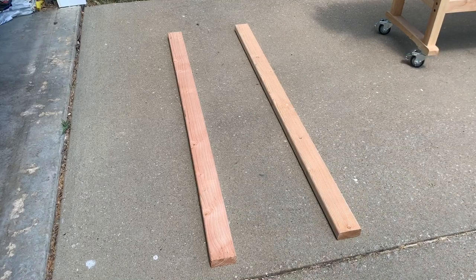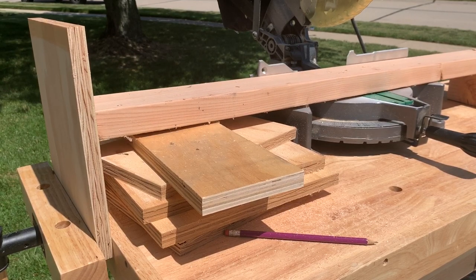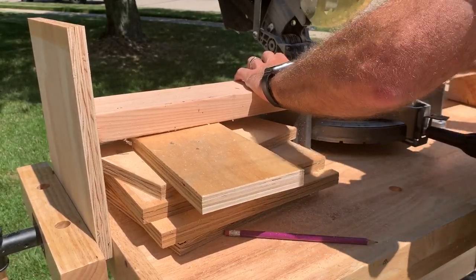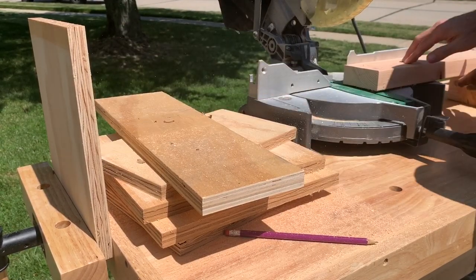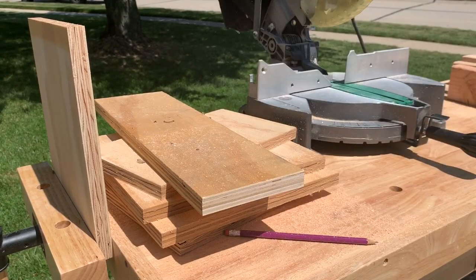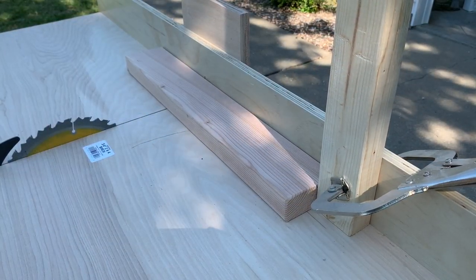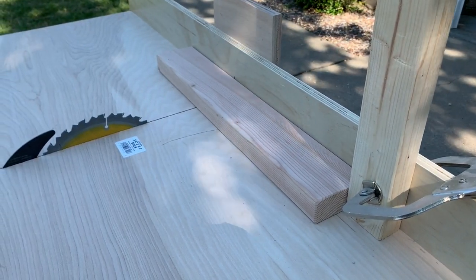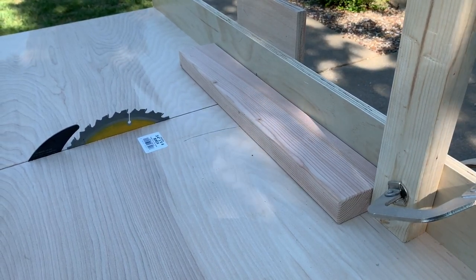Originally I was planning on putting the rungs on the outside, but my wife came home and thought it would look better to put the rungs on the inside of the rails — and I think she was right. So after I had them cut, I trimmed them down some more. To shorten the rungs the second time, I used the crosscut sled on the table saw because I had already sanded all of the rungs down by that point and it was already set up. I did this instead of going back to the miter saw and it worked out fine. You can see the stop block set up so they'd all be the same length.